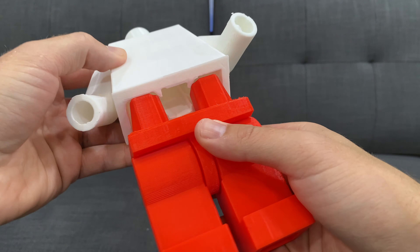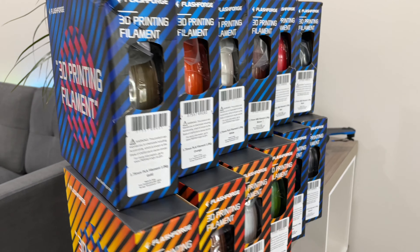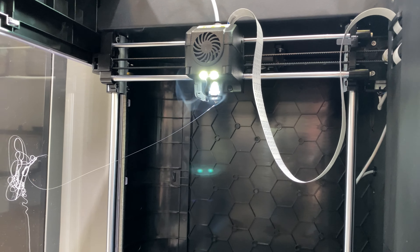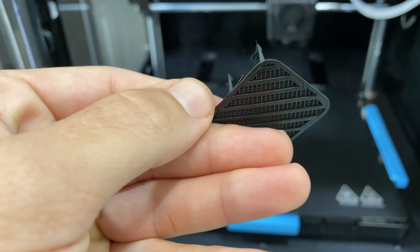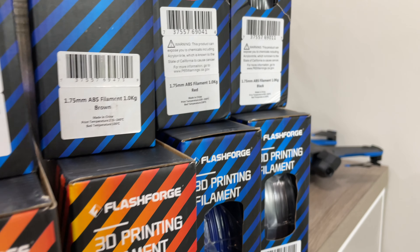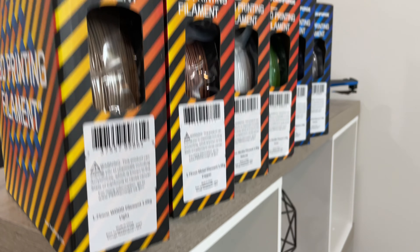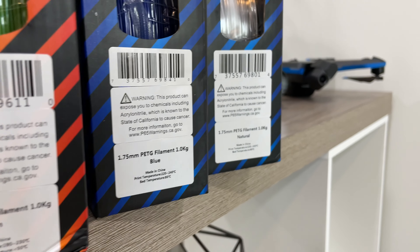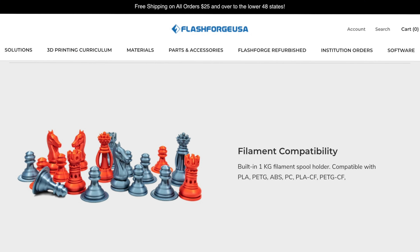My tip: PLA is my favorite — I can print it at semi-low temperatures super fast and it's usually strong enough for most of my needs and looks really clean. FlashForge USA was super nice and sent me a bunch of filaments to experiment with. With ABS I kept having some peeling adhesion issues, though a stringing test looked pretty cool. PETG turned out pretty sweet. I even tried their flexible filament, which is kind of a whole other beast — it needs to be printed super slow with zero retraction and I didn't have the patience to keep testing it. Swapping filaments usually went smoothly, though one got clogged. The machine is compatible with a wide assortment of filaments.